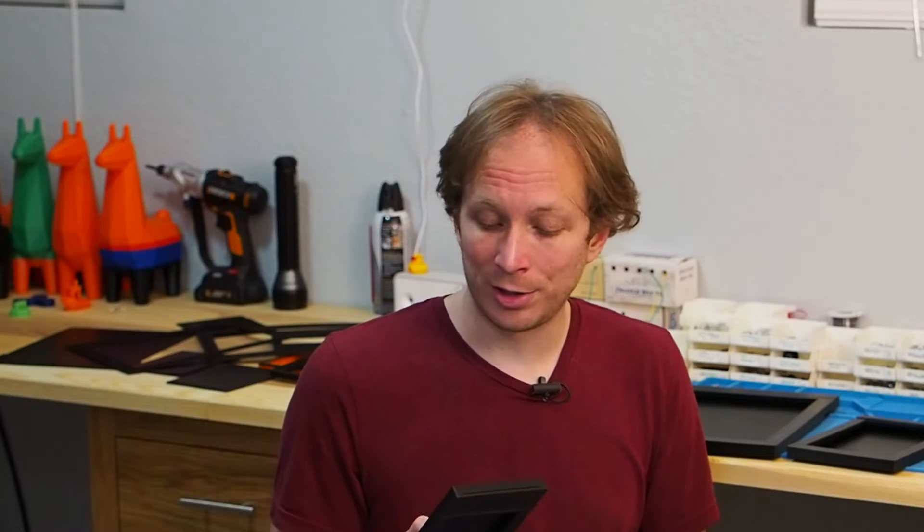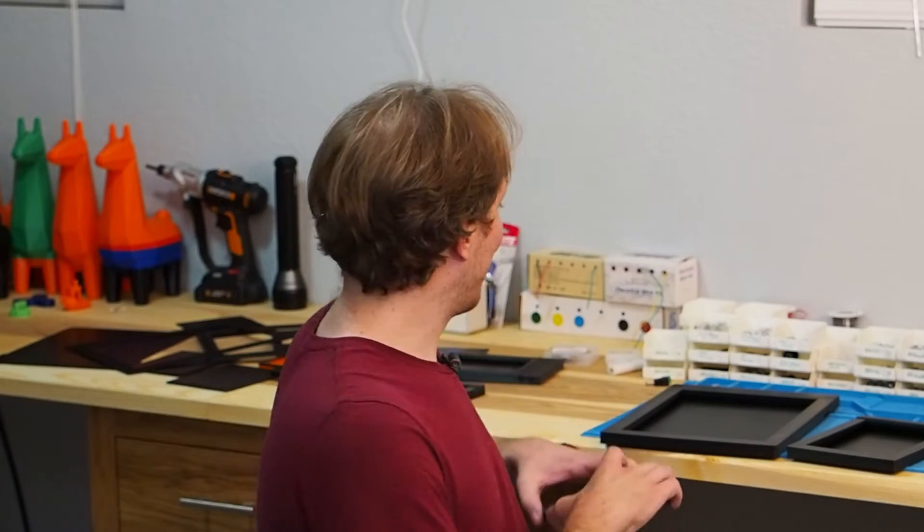That's my rundown of gripes with the holder design — the reason I've considered it a free holder rather than a great one. But recently I saw a company called Zebra Design selling 3D printed plate holders where the lid attaches with magnets. I decided to take that idea and adapt mine to use magnets, because magnets are super handy. They reduce the parts needed to assemble the plate holder and solve the basic problem with 3D printed closures — it's very hard to make a mechanical closure that is compact, secure, and strong within the limited thickness a plate holder allows.